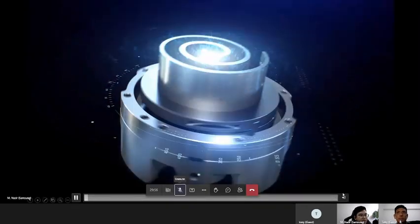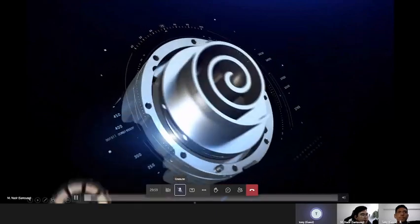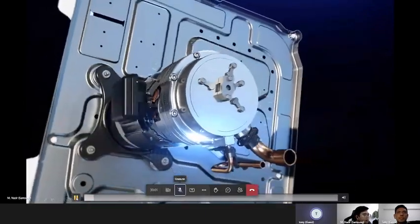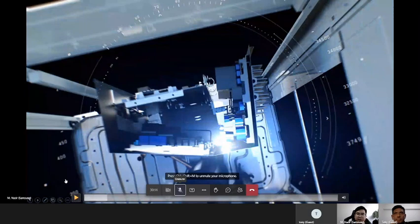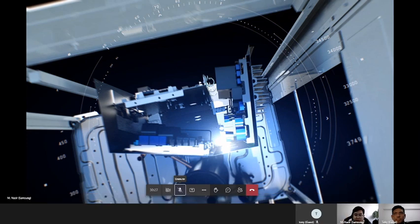Do you have the so-called multi-split unit? Sorry, come again? Multi-split unit, that means maybe 2 or 3 indoor, 1 outdoor multi-split? Yes, instead of using VRV. Yes, we do have, but unfortunately, it's not inside this slide. Basically, for our multi-split unit, we can go up to 5 horsepower for one outdoor, and maximum combination will be 5 units of indoor unit. So we have a few types of outdoor unit which can couple to whether two indoor units or three or four or five.